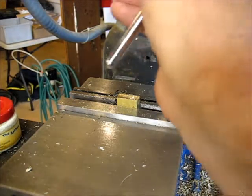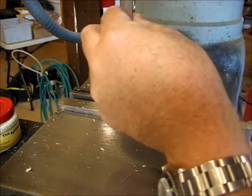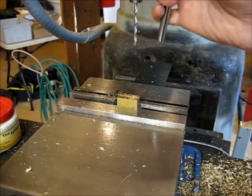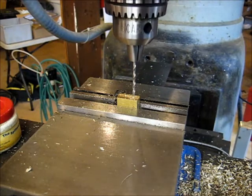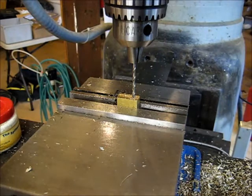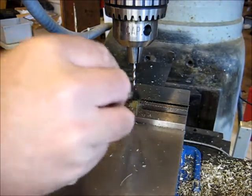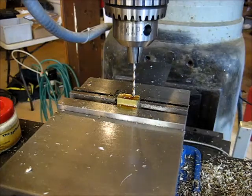For that 1/8 inch hole, again, we're going to do this at the knee. Prepare for drill chuck overload. So I'm going to bring this down, contact that spot, and then I'm going to come in a 1/2 an inch very gently, because you can't really feel this with the knee. Zero my elevation. Crank it up a little bit.